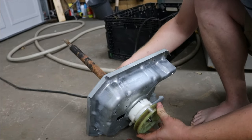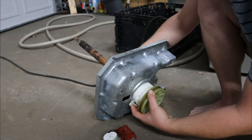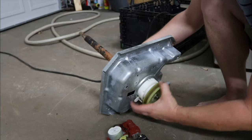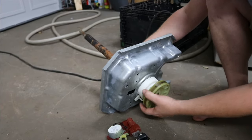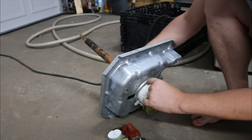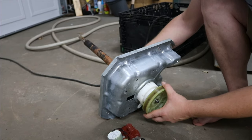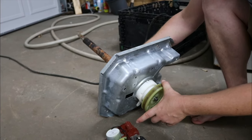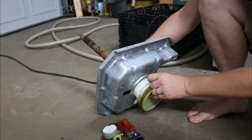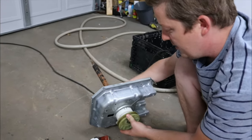One other thing: if the spring is going out on these and it's just half-shifting, you'll hear a horrible grinding noise. That could mean two things: either the actuator is starting to go out and it's not able to shift because it's maybe got grime in it, or that spring has lost its ability to push down hard enough and it's just not quite getting there. But more than likely it's going to be the actuator — most of the time that actuator is either burned up or it just can't push against the sand. Sometimes you'll clean out all that sand and oil it, but the actuator motor is still too weak to do it. It's just burned up from the sand being in it to start with.